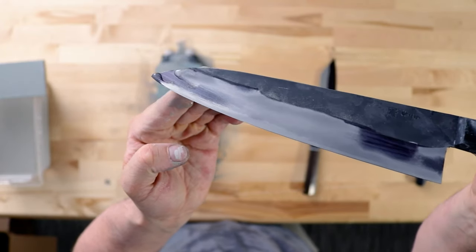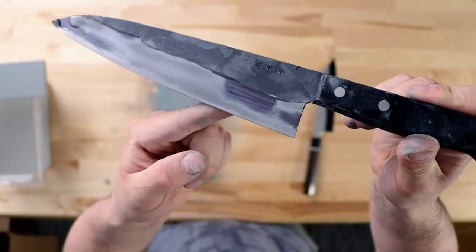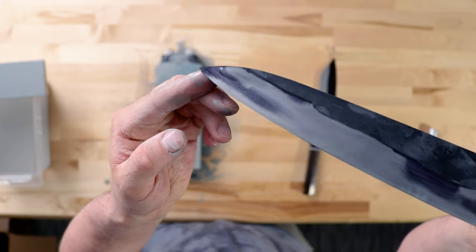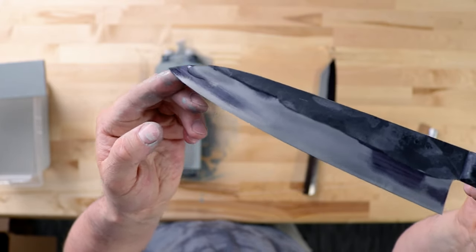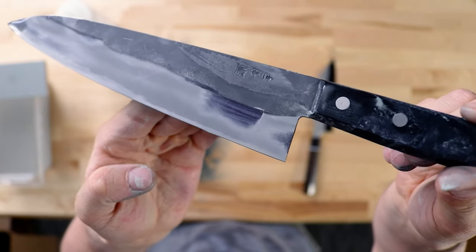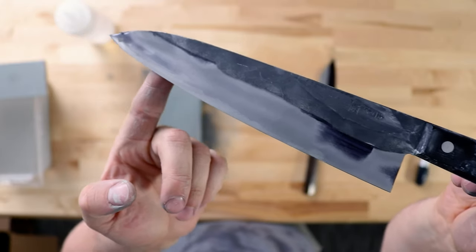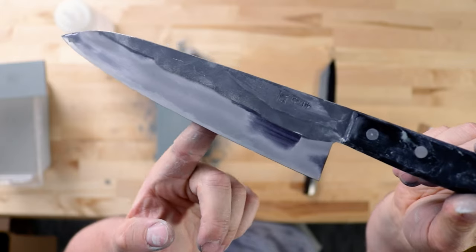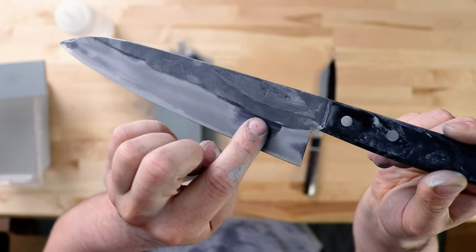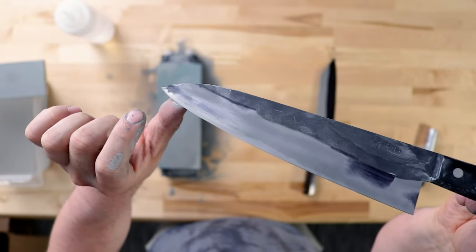Pass number one on the backside — quite a bit different than the front side. I've got a little issue to work on here, and up at the tip looks like a low spot from the sharpening wheel. After the second pass, things are coming along much quicker on this side. This is definitely a low spot — I made sure to get my fingers right up on the opposite side of the blade and there's no contact. Any extra pressure here is actually just going to bend the blade and put low spots in other parts of the knife. We need to get the rest of this knife flattened down to match the low spot we have here.